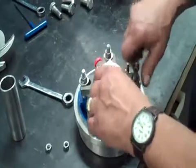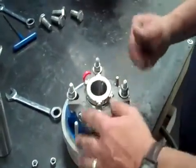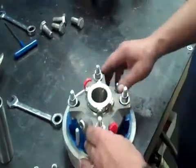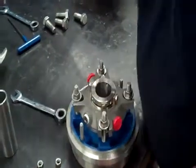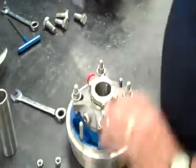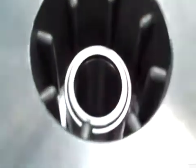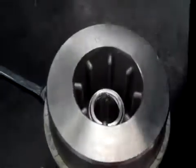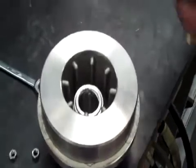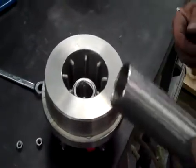The cartridge seal comes with these plastic plugs. We normally would put a stainless quarter-inch plug in it, but we don't need to do that right now. So once you get that in, you want to lube that back O-ring — it's going to seal on the sleeve — a little bit of lube. Then take our sleeve and put it on the shaft of our power frame.